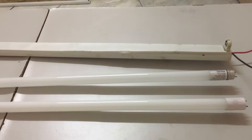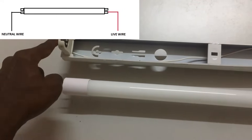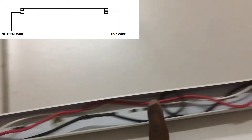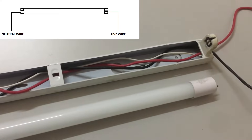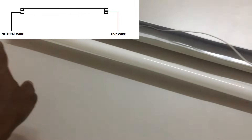Let's do a proper LED light wiring with the different LED lights so it won't blow up when you use different types. For this type of LED tube, the wiring is: one end of the LED tube is neutral, connected to the main neutral wire, and the other end of the LED tube is connected to the live, connected to the live main. This is the most common type of LED wiring used in homes and buildings, and the wiring is very simple.